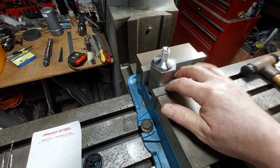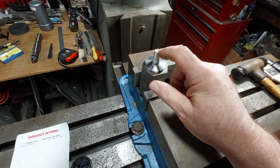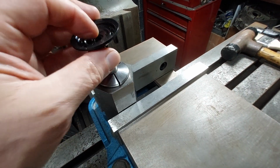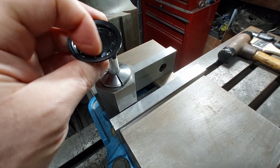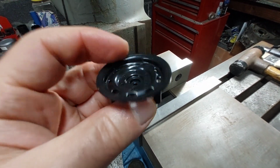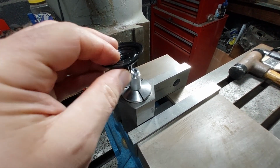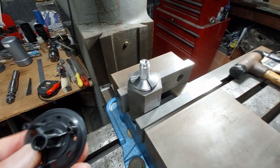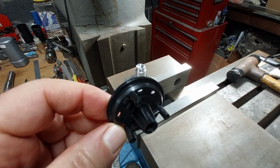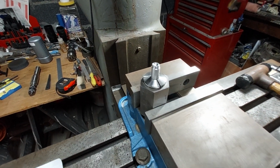And so I'll mill the hex on this, and then I'm going to drill and tap a hole in the middle, so I can screw this out of the arbor, put it in the lathe, and then I can machine. Actually, because it's just one small screw, I'm going to cut most of the excess off of this on a small bandsaw I have, and then I'll put it on the arbor, and I'll turn this and face off, get the backside flush, so it'll fit perfectly into Andy's kit wheels for the M8. So that's what I'm out in the garage doing today.